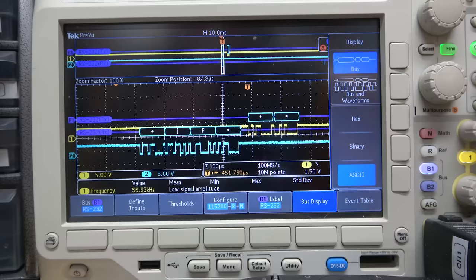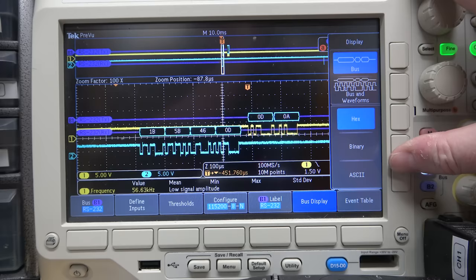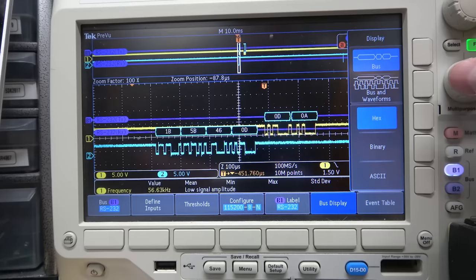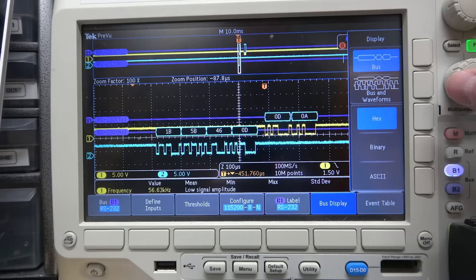I was searching Wikipedia. My best guess for this escape sequence, escape, left bracket, F, and then carriage return, the closest thing that matches is an X-term sequence: escape, left bracket, uppercase F, which means end. That kind of makes sense for inputting something, but then they've appended a carriage return onto it. The reason that's important is that if I were to try to sniff this and inject data from a separate terminal and also receive it, I would have to have the correct escape sequence attached to my enter key in order for it to work.